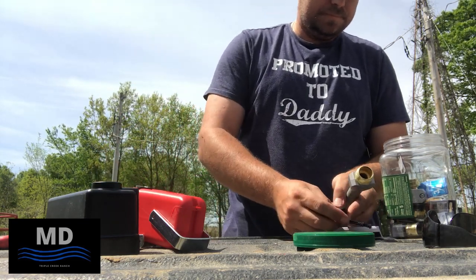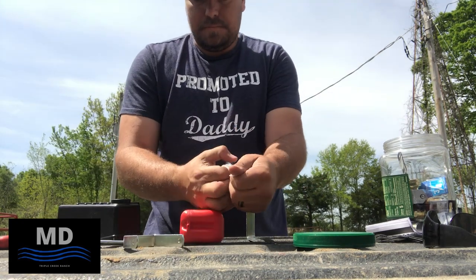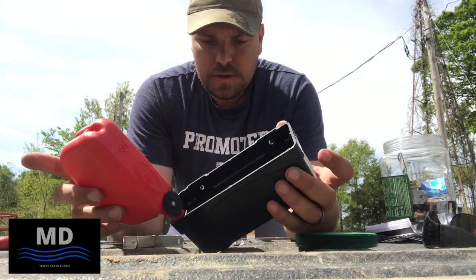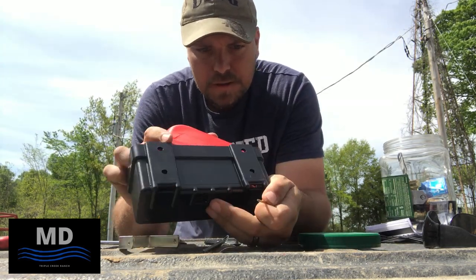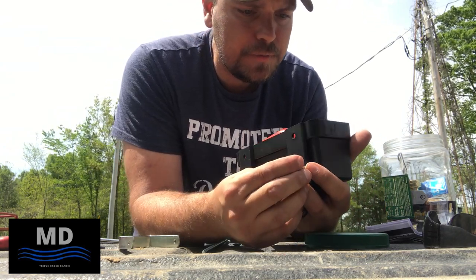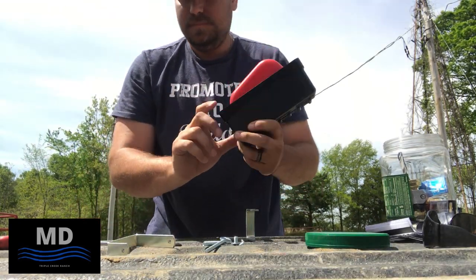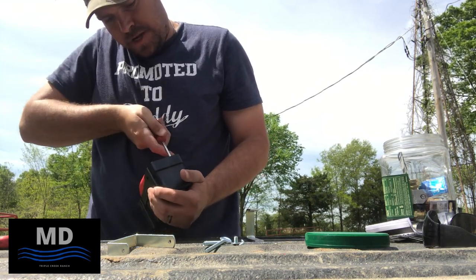So that's the garden hose fix. Now I need to actually build this, which is simple to do. Don't want to lose the washers. Your washer is just going to go inside here to make a watertight fitting with the hose. This float valve is actually held in place with the cotter key. All I'm doing is lining the pieces up on the inside and sliding this cotter key through. I'm going to bend just one end of it up just a little bit — not a lot, but enough to where it's not going to work its way out.